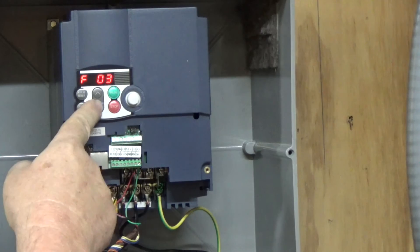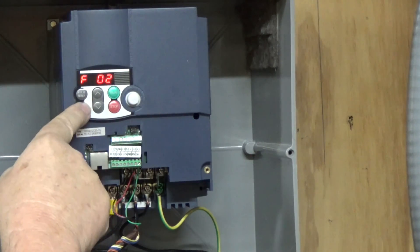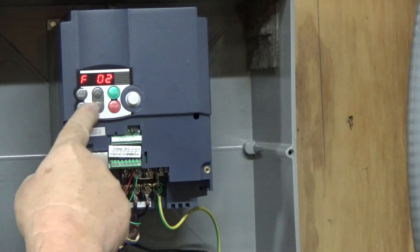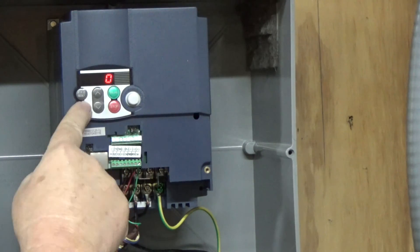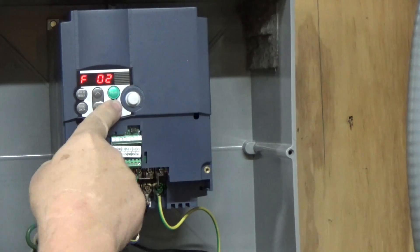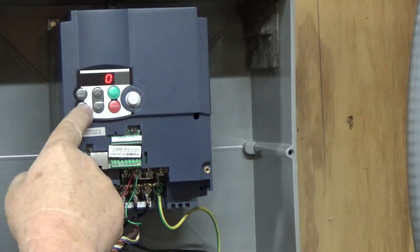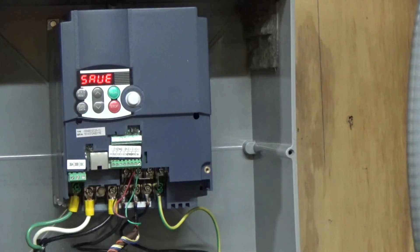Go back into program and function. 1F is where I want to be. Go down to number two and set that value to one. We need to hit the stop function first. Now program function number two — I want to increase that to one. Hit function data, it says save. So now all I have to do is hit the forward/reverse and it comes on without me having to hit the run button. Now I can have the lid on this machine and simply operate it from the forward and reverse switch up top.